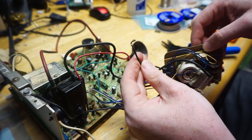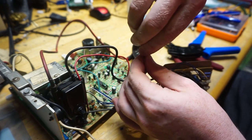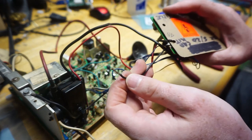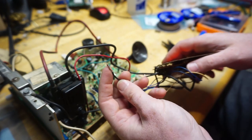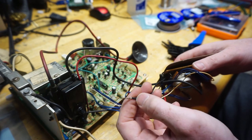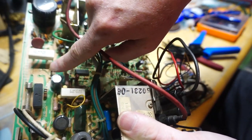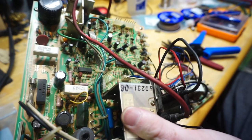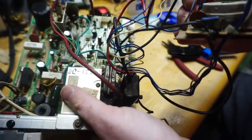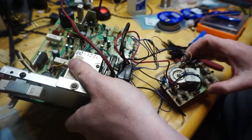I think we're just about ready to go back. The last thing I have to do is this ground wire needs to connect to the ground wire that comes from the monitor, from the shroud around it, basically. So I need to probably just put a spade connector on this and on the other one. The other one already had one of those large posts that actually looks very similar to, say, the degauss post that you'd see over here. But I don't have these things separate in any way, and they're not for inline anyway, so if I were to use that, you'd want to mount it to the PCB, and there's no space for that. So I'm just going to attach a spade connector.